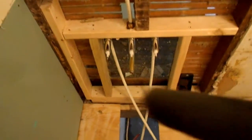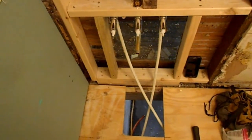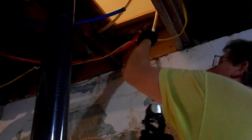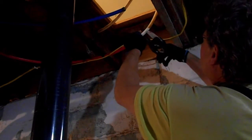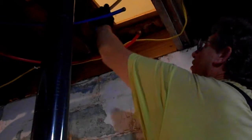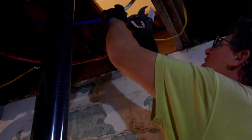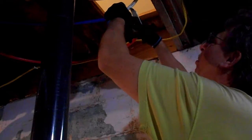Okay. So let's get set up in the basement and I'll show you how to make these connections down here. All right, show you more. Okay, so we know this one goes to our hot side of our faucet, and we want it to be about right there. That one off. And this one is for the cold side, and because we're going to put a 90 in here, is what we're going to do.